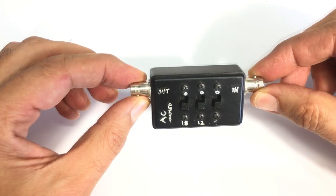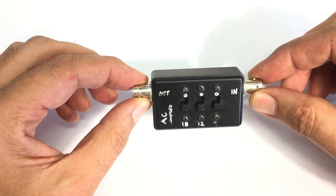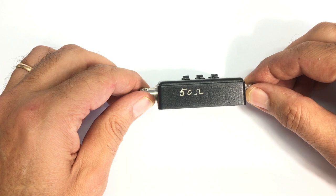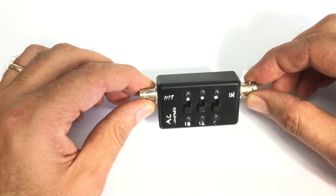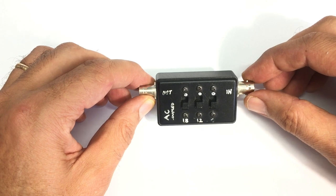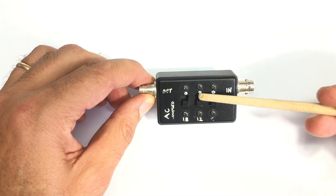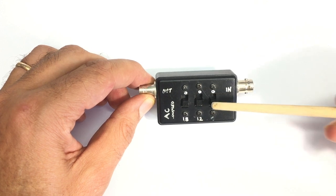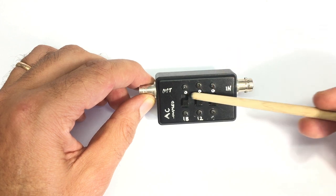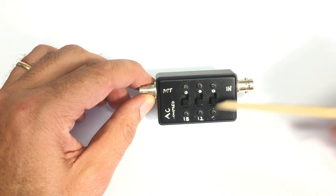If you've been watching my channel for any length of time, you would have seen me use this guy quite a bit when I do the IF alignments of tube radios. Now, all this is, is an RF attenuator, 50 ohm input, 50 ohm output. This is to match the output impedance of my signal generator. And what it does is it allows me to apply three attenuation levels. I have a 6 dB, a 12 dB, and an 18 dB switch. I can switch in any combination of those dB values and they just sum as I need it.